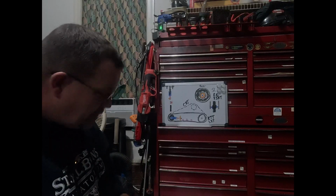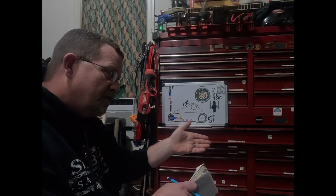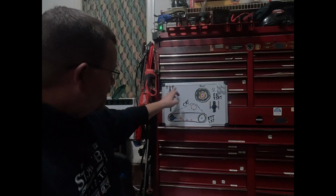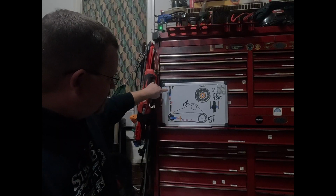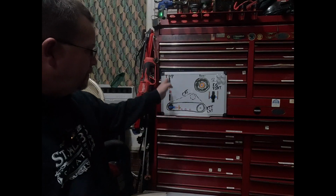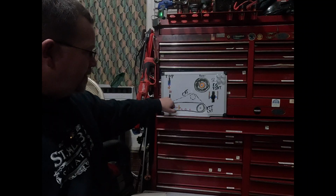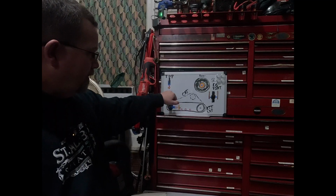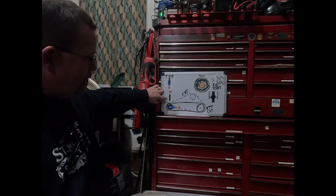Okay. The other thing is kind of check your frame. Make sure that your frame's not twisted inward. Make sure that everything is straightened down. Now, I don't have the frame on this, but this is pretty much what you want to do: check and make sure that your front idler, so you're getting ready, you want to make sure that everything is uniform. You don't want to have a shot of maybe your bearings going out here, maybe your drive motor's got an issue back here on the motor and the seals, or if you had the CRT, the same thing up here. So you want to make sure that this is pretty much straight down.